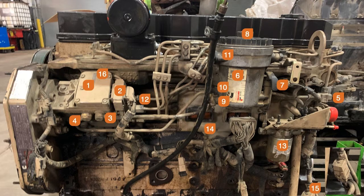On the back side, right above number seven, there's a banjo fitting from that line off of number 13, and that fills that aluminum housing number six up. As soon as fuel started to come out by the O-ring, we would flip the switch off and tighten that number eight cover. There's a big plastic cast nut on top of it so that you could put a ratchet or a crescent wrench or a big set of pliers to get it loose.